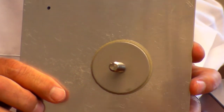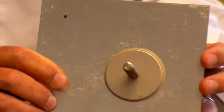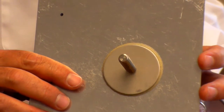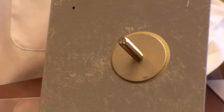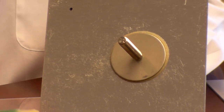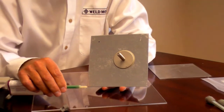The part stays right there — it doesn't sag, it doesn't slide. Within eight minutes, we'll have fixture strength, which means you can't knock this off. Should you want to get it off, you'd want to do that before eight minutes and wipe both surfaces with alcohol to get it clean. As far as the working time and the tip, if I were to put this down for four minutes or so, it would begin to have its exothermic reaction, and I would have to replace this tip and put a new one on to reapply.